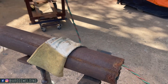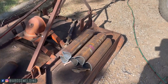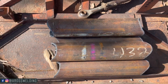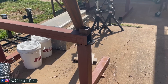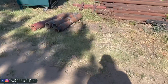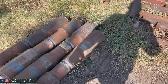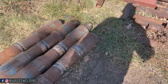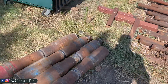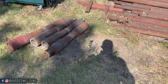The rest of it will just be four-and-a-half-inch pipe, which is what we're working on right here. We've got several of them cut, just a couple more to cut out. I did not bevel these or anything, but I did use 7018 to weld them together. I just slammed them up, might have left a tiny gap, then turned my weld machine up and just welded it uphill all the way around. I didn't even put a straight edge on it — I like to call this farm status.